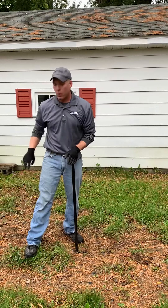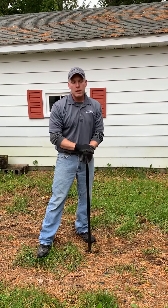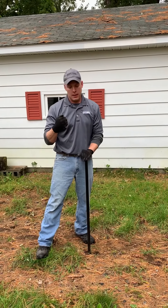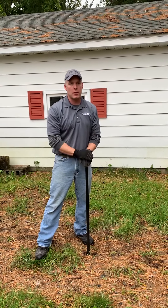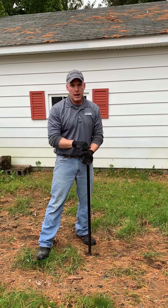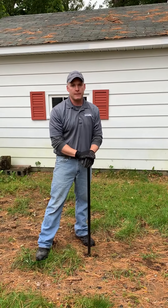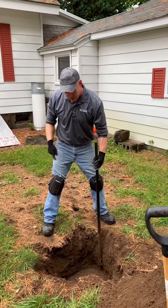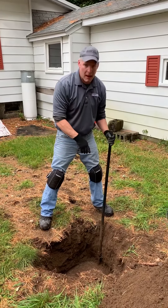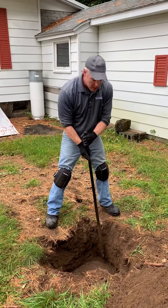There's a miss. We come over here and I have a hit on the concrete. Over here I also have a hit on the concrete. The pipe is coming from there, so this is going to be the inlet. I'm looking for the outlet side, and what I'm doing with that pencil tip is — once I work it down onto the concrete — I work it back and forth feeling for it to catch on a seam or a handle, because I'm looking for the outlet port. I don't want to dig up the whole thing, so I want to find exactly where that is and hopefully only dig once.